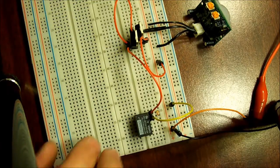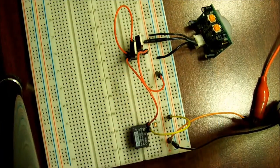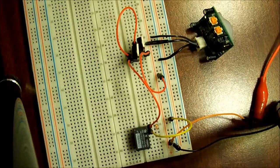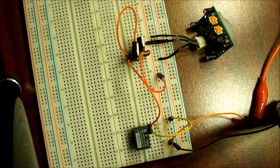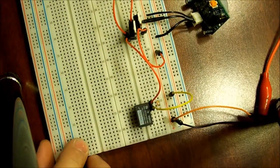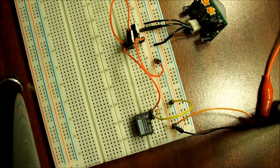The circuit is not perfect because these transistors require a 5 volt switch to actually turn them on and off properly. I'm only getting 3 volts from my PIR. So it puts the transistors into a linear phase — from what I've read — and it causes excessive heating of the transistors. Now, this is not much voltage; these transistors are good for 100 volts, so they're not even really warm. But if you had more current going through them and you're only switching at 3 volts, it could cause excessive heating and you might need a heat sink. I'm not an expert on transistors — I just know this is what happens to be the case with this one.